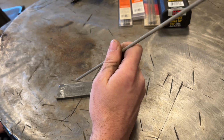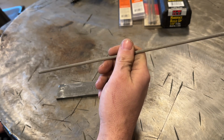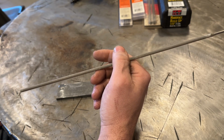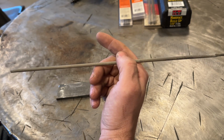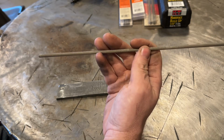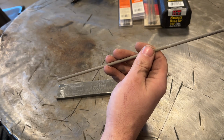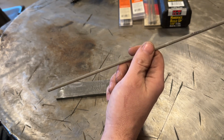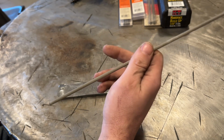Don't rush it. And if you're welding this stuff on say a 3/4 inch thick excavator bucket or something, guess what? When they say 200 degree preheat, that means the whole way through the steel. You do not want to just get a surface temp at 200 where in 5 minutes the surface drops from 200 to like 70. You have to heat soak the part in order for that to work. And the most common failure of these is you're going to finish welding and like, oh man, that looks good. And then all of a sudden you hear a ping. When you hear that ticking or pinging, that's the weld breaking off of your base material. The second you hear that, you have a failure on your hands, and you'll be able to look back at the toes of the welds and you'll find it cracked right off.